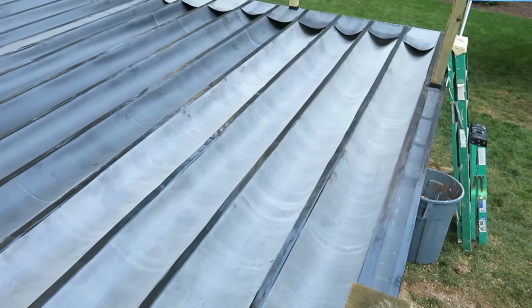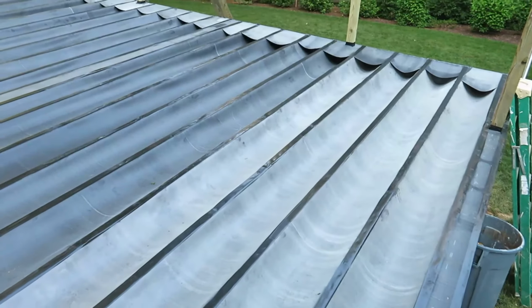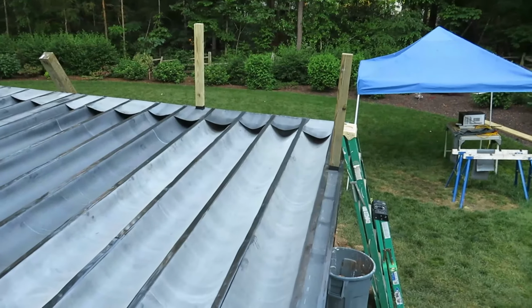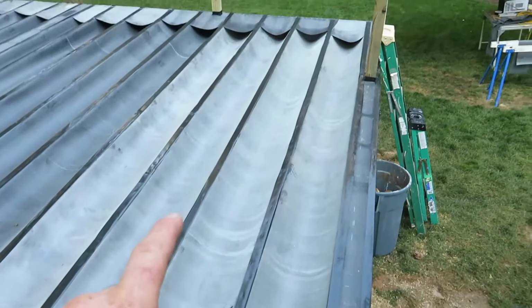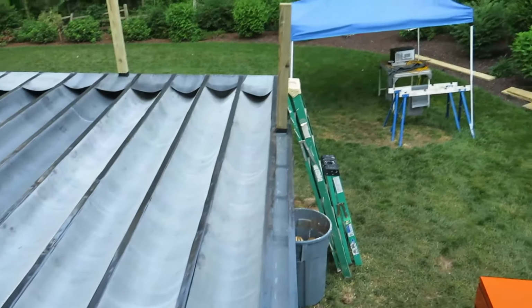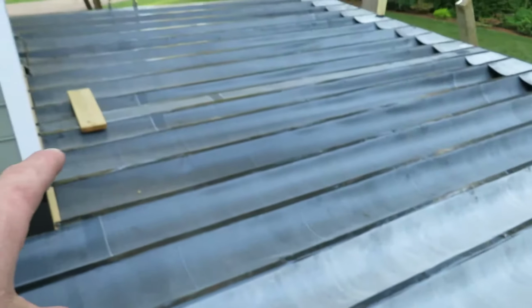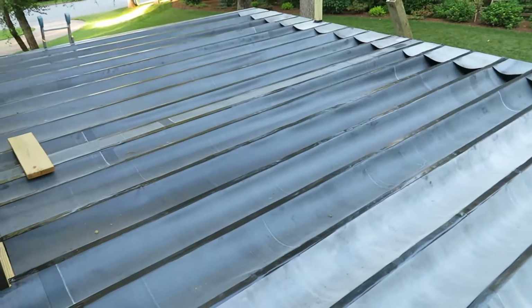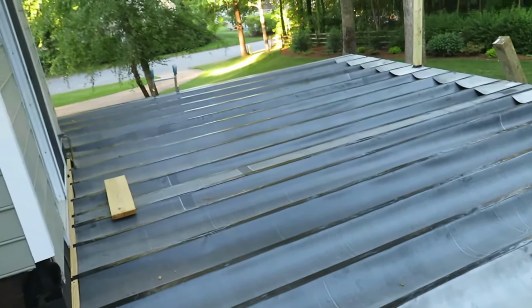All right, all of the waterproofing is complete and taped off and everything. So hopefully you can see the entire system as it's come together now. Just like before, we have the troughs that go in between each joist that get deeper towards the end. And then across both end sections and this middle section right here, where we're gonna have a deck board going perpendicular to the field, which you'll see later on.